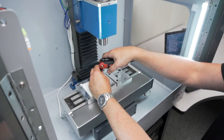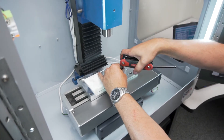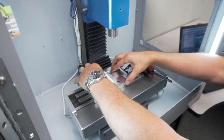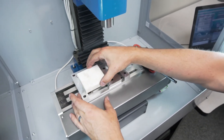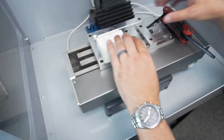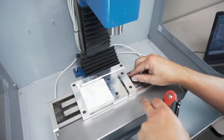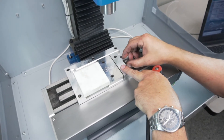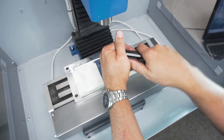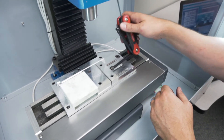Now we'll cover putting it up in the parallels position. We'll break everything loose, snug it just basically make it snug, and loosen this up. We're going to lift our workpiece up and put it against the inside edge of those corners — now you're supported on three axes. You don't have to be supported on three sides; you could just support it along the front edge, which is what we'll do. Snug it along the front edge, set it in place, and make sure we're good and snug on the back piece. Adjust the screw back so we've got a full amount of travel and lock that down.